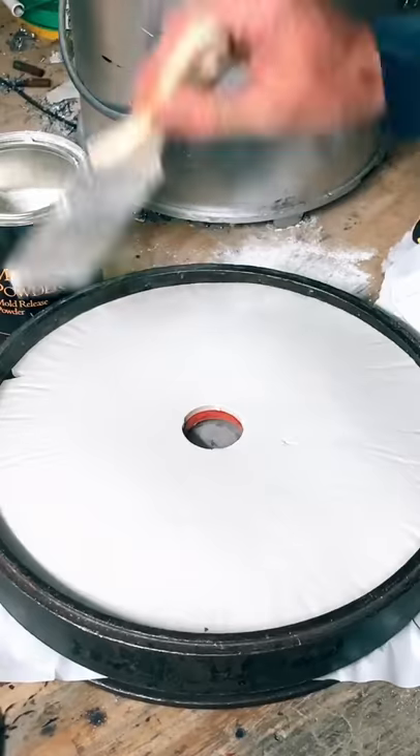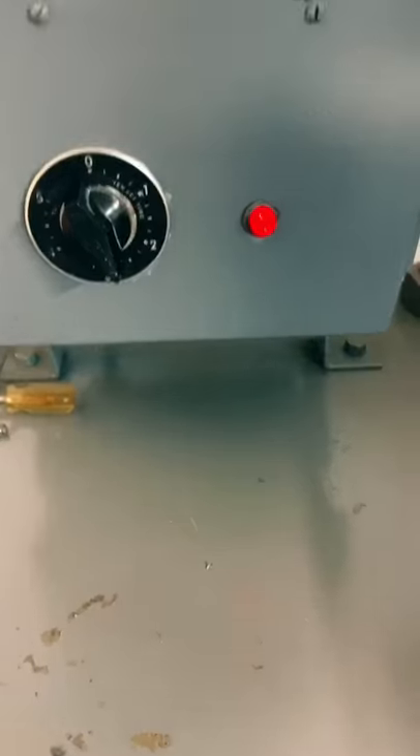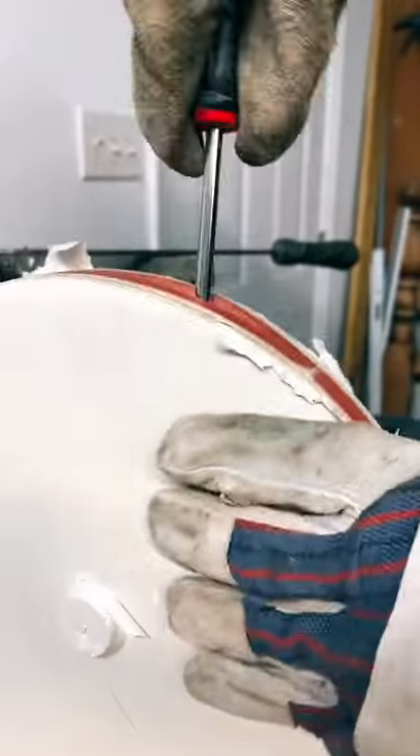Next step is to add a little powder, a little paper, and the top of the mold frame. We take the mold over to the vulcanizer. Cooks it at 315 degrees under 3,000 pounds of pressure. After an hour it's done. And that's how we make it.